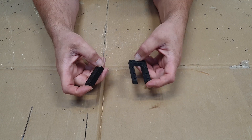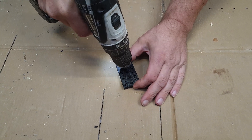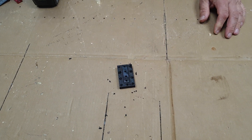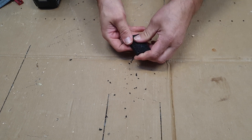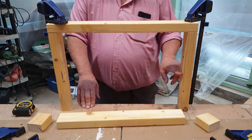This is what we came up with. It's 3D printed in PETG. If printing for outside, don't use PLA as it is biodegradable and will fail in short order. Before use, the appropriate sides are countersunk. If I was making lots of them I might re-engineer the print to include chamfered holes, but the handful I've used here, manually countersinking has not been a great hardship.